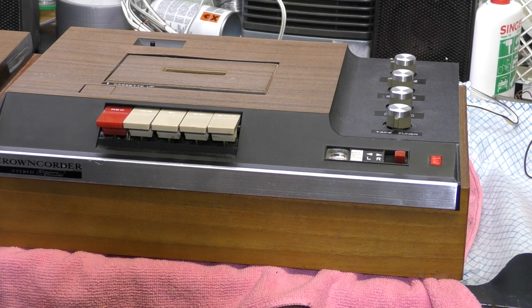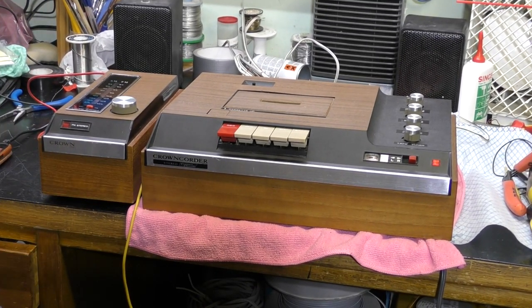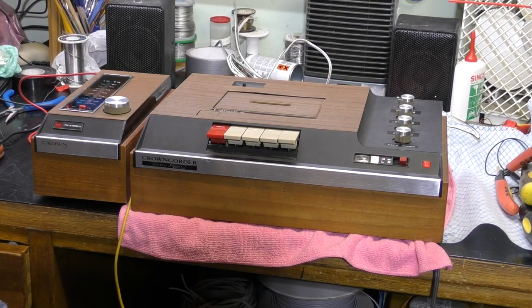Not too bad for a unit that I've just discovered is from 1969. I had a look at the capacitors and they're not in bad condition actually — most of them have risen in value slightly but not a huge amount. So we know this is 1969, which accounts for the cassette mechanism and what's inside. An interesting thing — I've never owned a cassiva before, so I guess this is the closest I've got to owning one, but it's a very interesting unit. So that was the Crown SHC-44 from around 1969 — a portable cassiva, the closest you've got to a portable stereo radio cassette of the age, and quite advanced for its time. Thanks for watching and I'll see you soon.